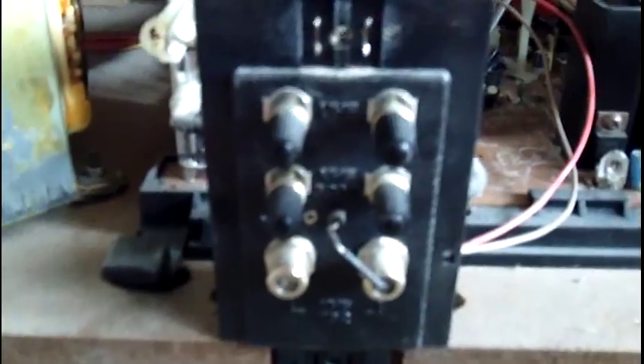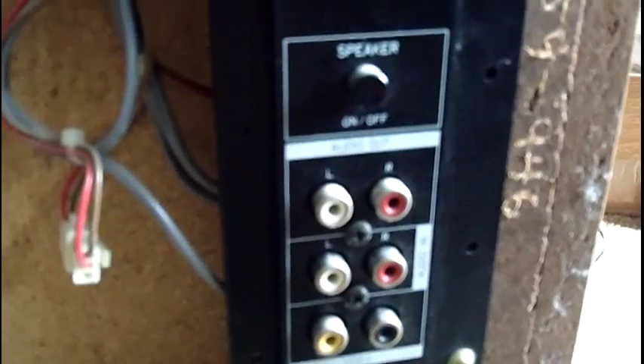There's no composite video input on this — this must have been a little too soon for them to start worrying about putting composite video connections in. So you'd have to use a modulator if you want to do that, and you can't put separate audio in either. There's a spring here that goes off somewhere — I thought maybe it tied into the high tension lead — but I'm not going to fool with it. It works great.